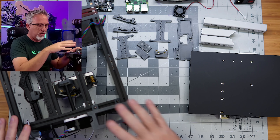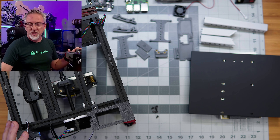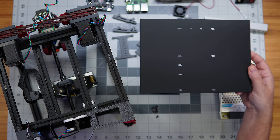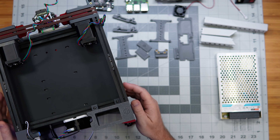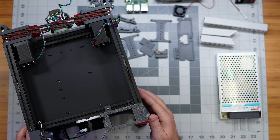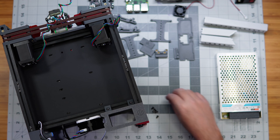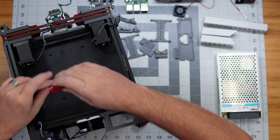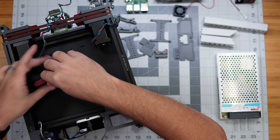We'll tackle mounting all the hardware first and then wiring it all up. The first thing we need to do is put this sort of mid back panel in — it just slides in to the back of our printer here. I've already pre-aligned the M3 nuts that we slid in long ago onto the backs of those extrusions, so all we should have to do is bolt this down to hold it in place.